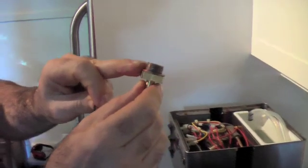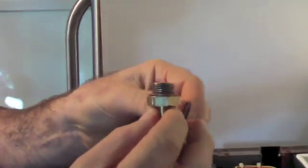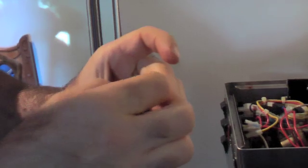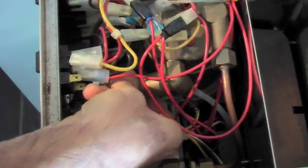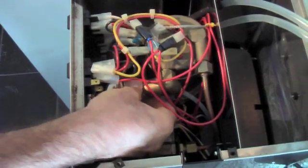This is the copper washer that comes with it, and this is a washer that I have. I'll put the copper washer on and then put this back — obviously with the spring and piston — and that should mean there's less compression on that spring, so the valve will reduce the pressure in the system. Getting it back in is a little bit tight but not too tough. There — I'll just tighten that up with my channel lock pliers.